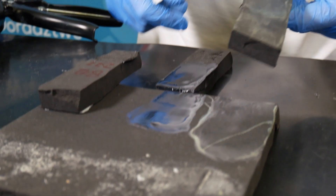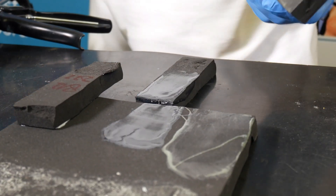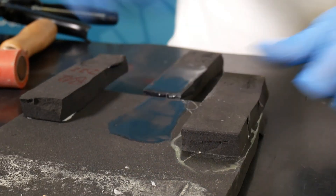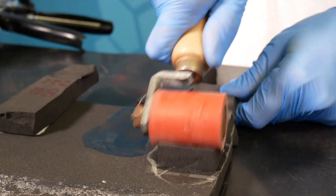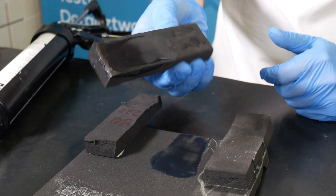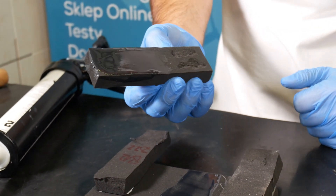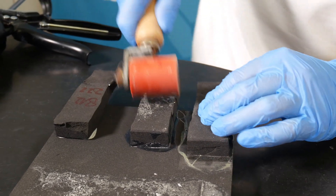The U800 glue has already dried — see, it is slightly sticky. We press down, and for larger areas we can use a roller to press down. Glue 901 — let's give it 2 or 3 more minutes because where I applied it thicker, it still needs to dry. Once dried, same thing: we press and run over it with a roller.